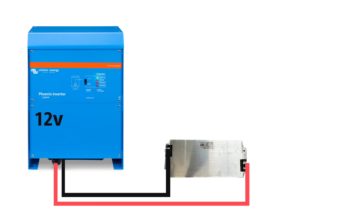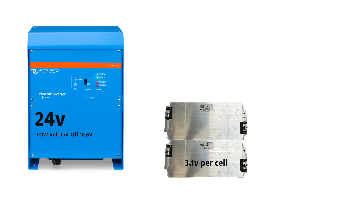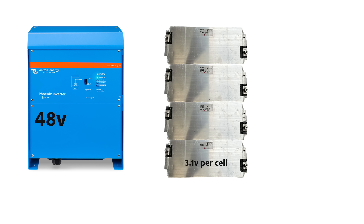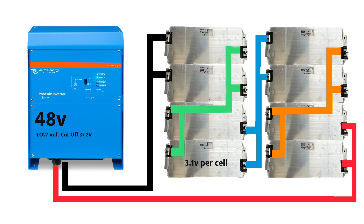200 amp hours is equivalent to 84% — which is exactly what you want if you want this battery to last a long time. You can install this in the wall with regular 12-volt equipment and it'll use it until it reaches around 80%, because the last 4% is where the alarm starts going. But here's the great thing: if you use Victron, you can set the low voltage cutoff as low as 9.3 volts on the 12V system, putting your cells around 3.1 volts — perfect low voltage cutoff. For 24V that's 18.6V minimum, using two modules in series (six cells), also landing at 3.1 volts per cell. For 48V the minimum cutoff is 37.2V — same thing, cells at 3.1 volts.